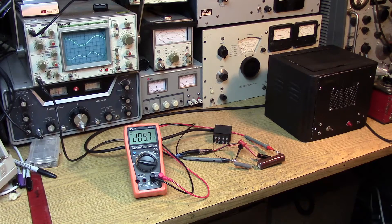I went in and investigated the power supply to see if there was something that might give itself away. I found an unsoldered post — a solder lug — where I had all the wires wrapped around it properly but failed to actually solder that one connection. So that was a good exercise to re-evaluate the power supply.